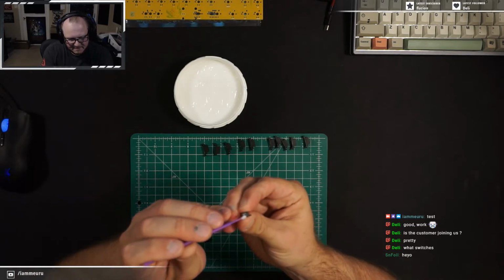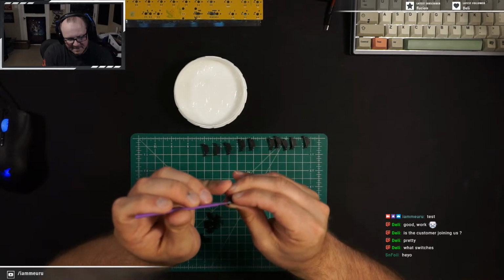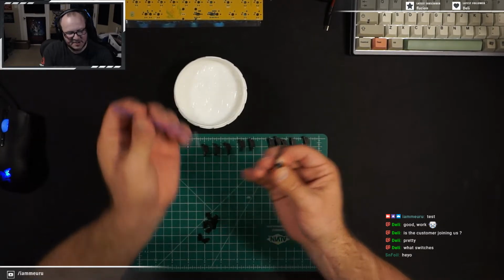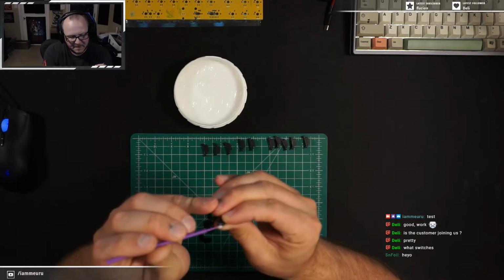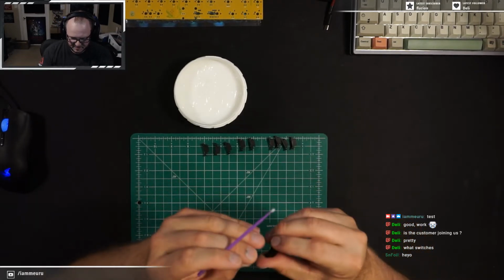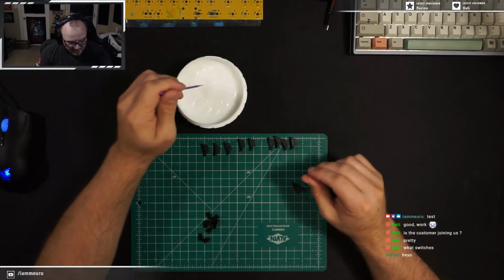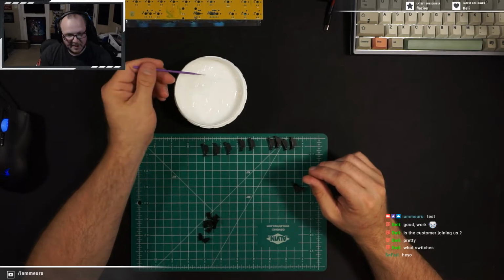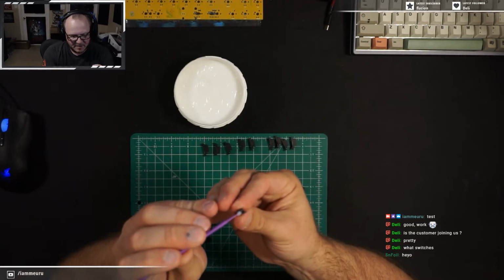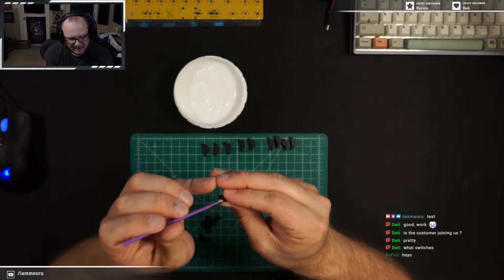So this is, honestly, in my opinion, if you guys are building your own boards or anything, the step that gets you the absolute biggest, most premium modification or change that you can do that will improve your typing experience as you use it, and that is lubing your stabs. Because frankly, just pull up any OEM board and listen to the rattle that the stabilizers have, and that's 100% addressable with a decent lube job. I shouldn't say 100%, right?